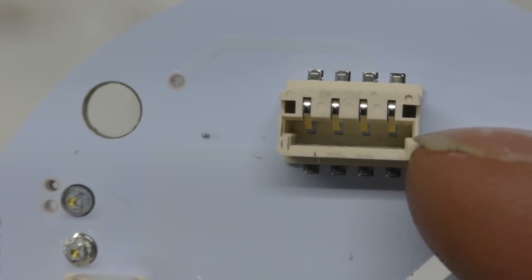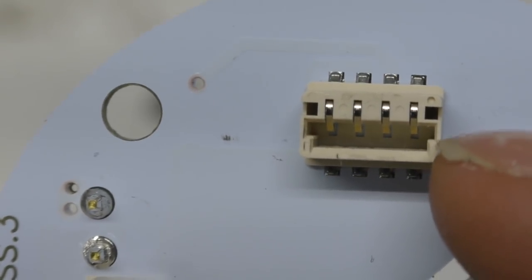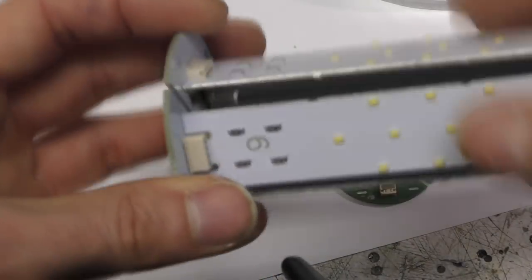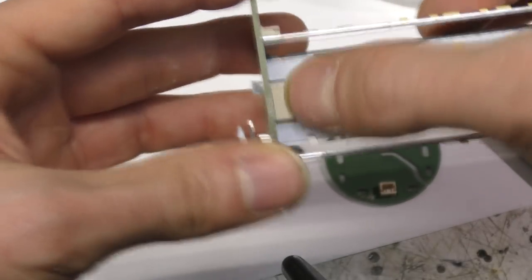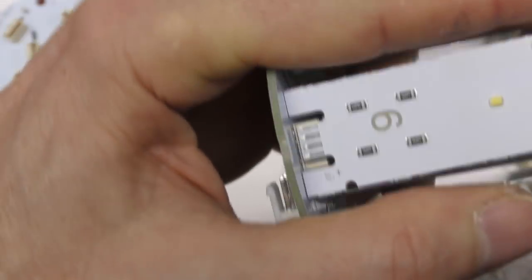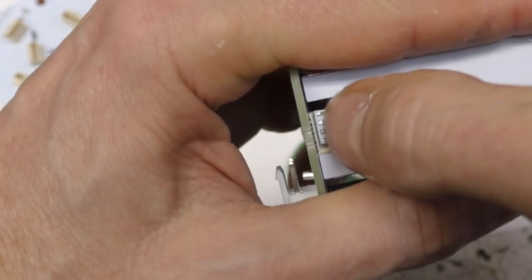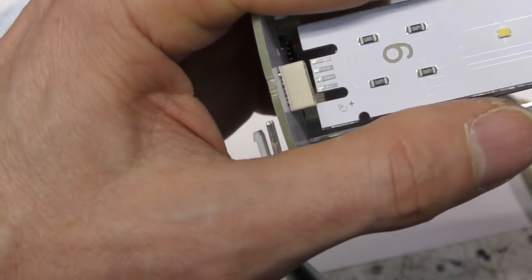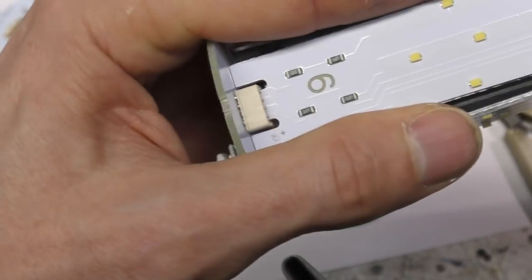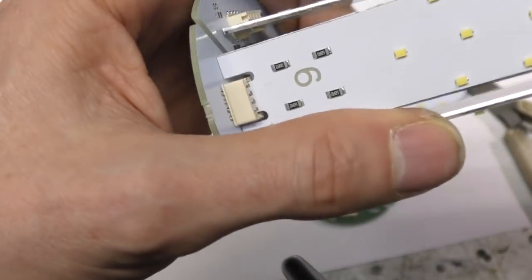Another nice detail is they've got this stepped entry, which means you can use either 1.6 or 0.8mm PCB with them. For a 0.8 you just make it slightly wider so it fits into this outer slot. One thing I didn't want to do is have this clamping force putting force directly on this connector, just for robustness. So I put some landing feet, so these feet land on the PCB and define the position and geometry, and there's a small tolerance gap here, so that when this is plugged in, the bottom of that tab is perhaps 0.5 millimetre out of the bottom of the connector, so it's not putting any strain at all on the connector body. All the force is taken by these feet landing on the PCB.